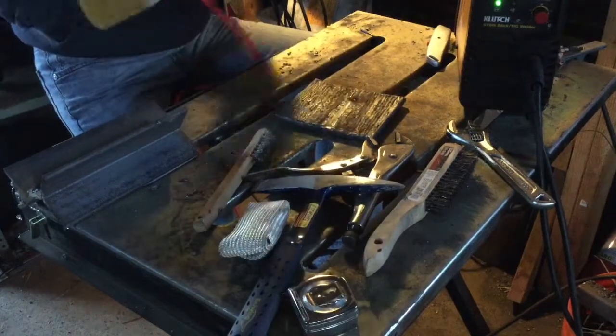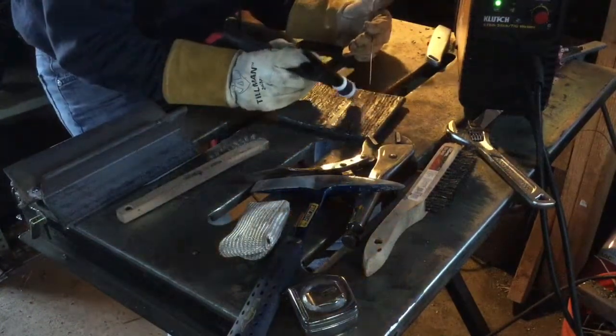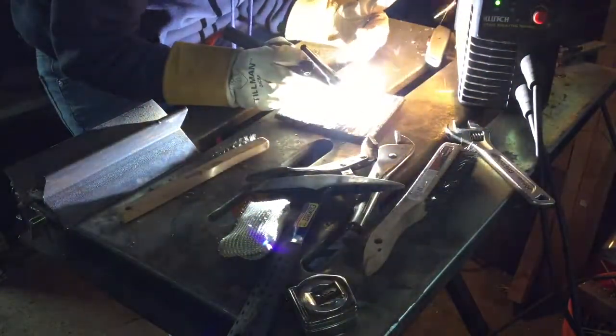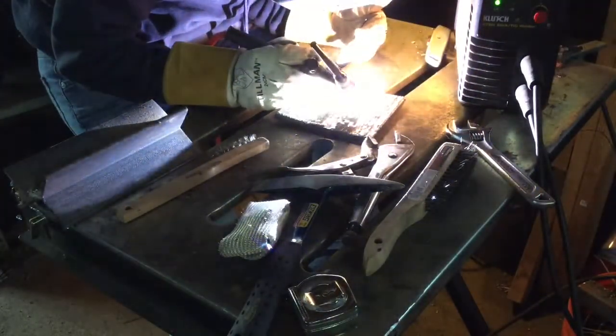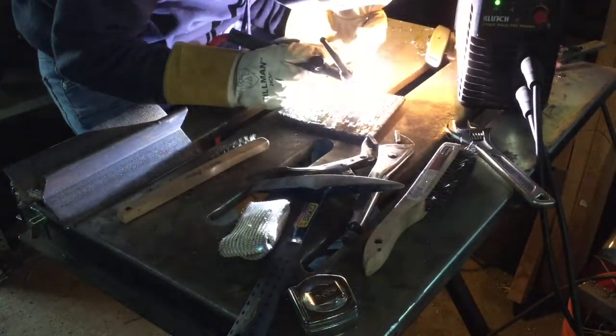And that's what it looks like when you don't TIG weld with gas. I have muted the video, but I just basically yelled gas. You can see that's where there was no gas. I should have ground that out, but I'm going over and dipping in the ER70S2, and that seems to help. Then I just kind of weld along, weld along, and I'm good to go.